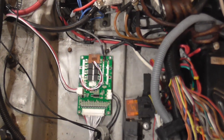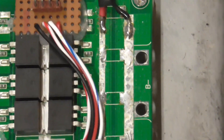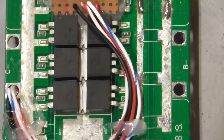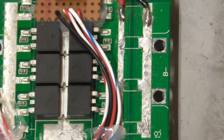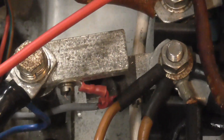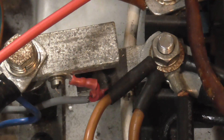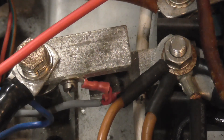The other thing I have done — that's the modification covered in the other video — you can see those two wires soldered onto the board. They replace the current sense resistors. You can see those three empty rectangles; there were three more on the other side of the board that were the original current sense resistors. Those have been removed, and that wiring now leads to this device. You can see the little red terminals and one screw terminal — that is the high current sense resistor, rated for several hundred amps.